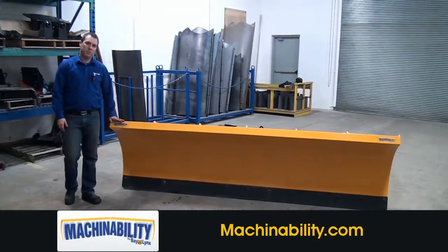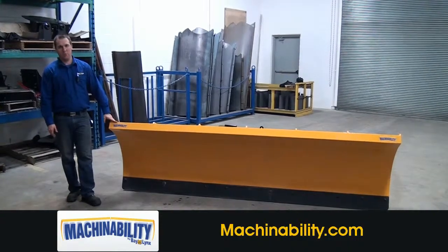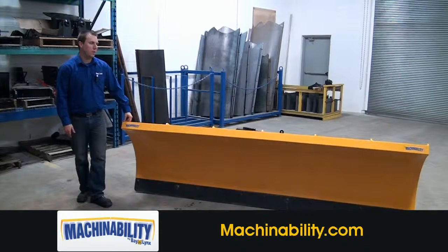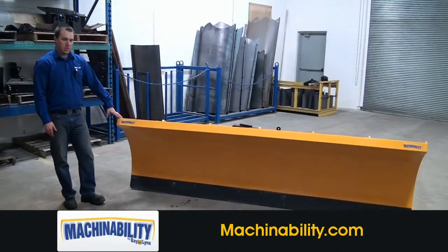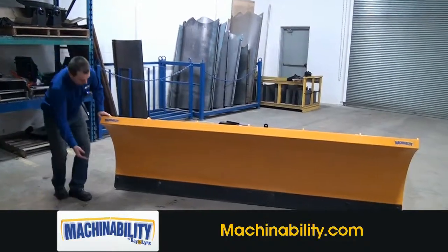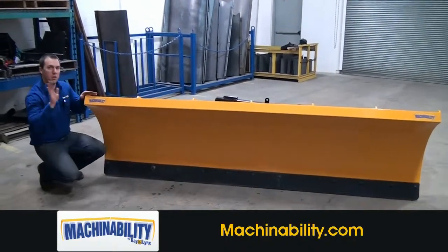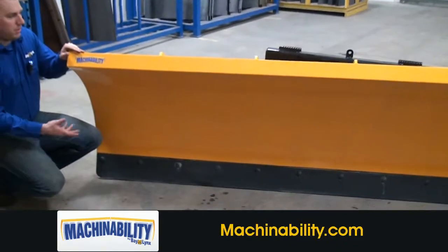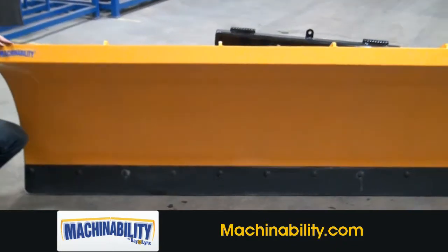This is the 35 series straight trip moldboard plow. It comes in two sizes, the 10 foot and the 12 foot. The way that this plow trips, other than the trip angle plow, is that when there's contact with something at the cutting edge, the whole moldboard will tip forward, causing the plow to avoid the obstruction.